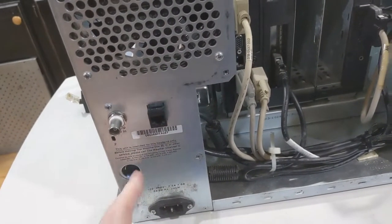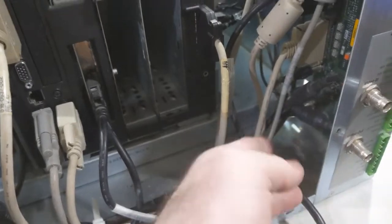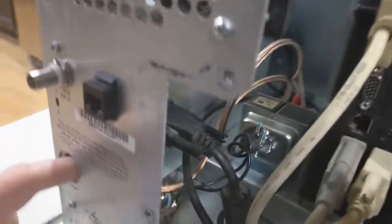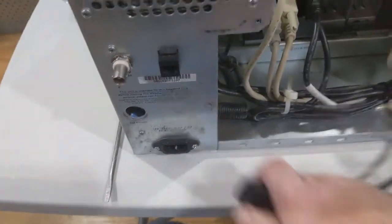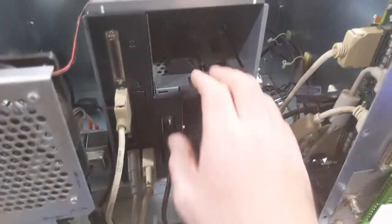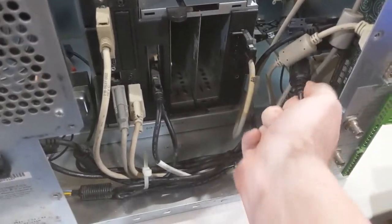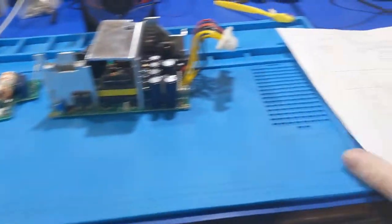The SAT scan board had this DIN connector power, so I removed that and just kind of shoved it off to the side because it requires a weird 9 volts AC. I removed that and drilled a hole on the side of the case so I can run some wires out and mounted a transformer in. I now have AC voltage from that transformer, with the primary wired in down here, so I can plug the power in and it runs both the transformer and the O2 machine.